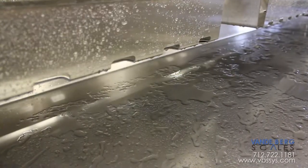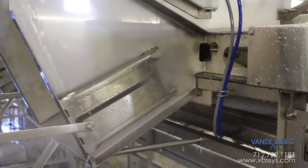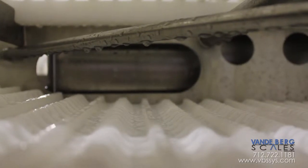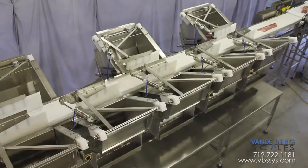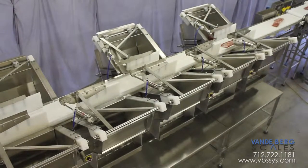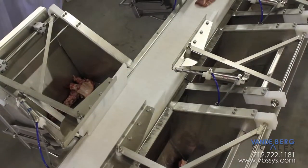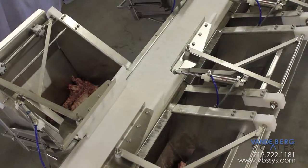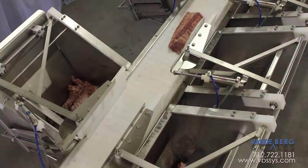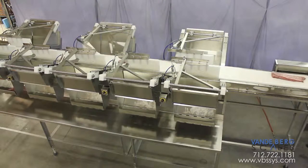The entire system is made of stainless steel and wash down approved material. All belts are made of wash down modular plastic belting for long life and less maintenance. Preventive maintenance and machine adjustments can be performed using standard tools. The conveyors can be run without sorting through a switch on the panel to turn off the diverts. This system also includes a method of releasing pneumatic energy when the system is locked out.